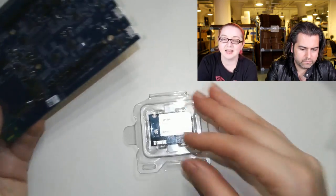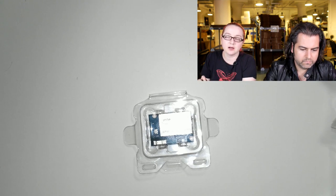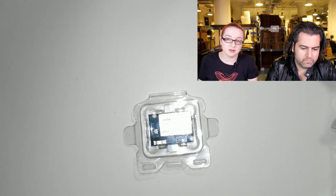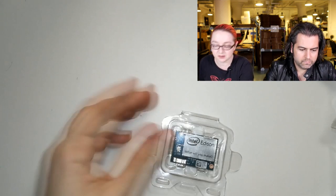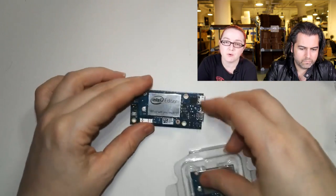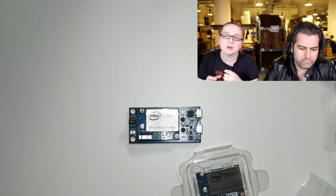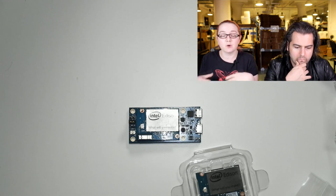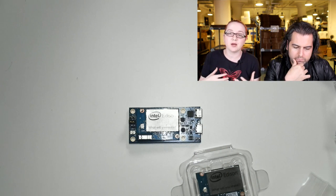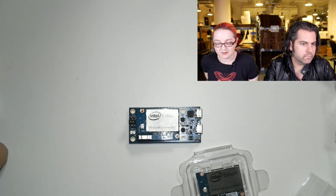So, it's basically running a Linux distribution. You can kind of treat it like a low power, very small Raspberry Pi, except it doesn't have a display, and it doesn't do HDMI, but it does have Wi-Fi built in and USB built in, and also you don't need an SD card. It's self-running. It has flash on board, so it's an all-in-one, and it's meant for small projects. Let's say you're doing a robot and you want to be very small, you don't want a full Raspberry Pi or a full BeagleBone on it, a teeny little board. You want wearables, or maybe a quadcopter with a lot of processing power on it. This would be a really good match for a project like that because it's very powerful and it's running Linux, but it also has this small form factor. It has wireless capability built in, but it's easy to use because it has the Arduino IDE that you can use with it.